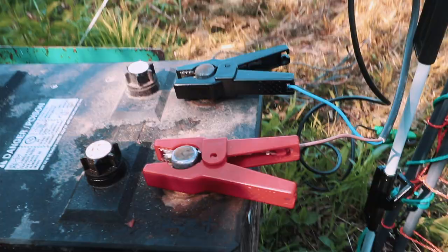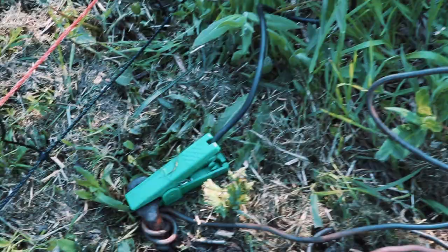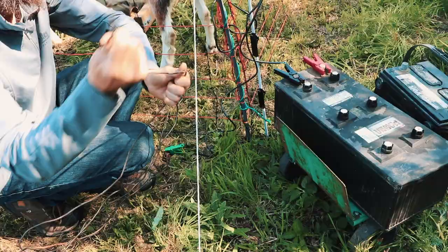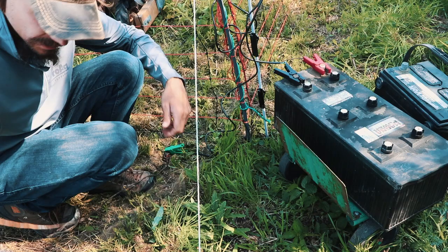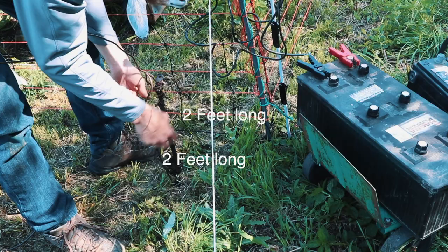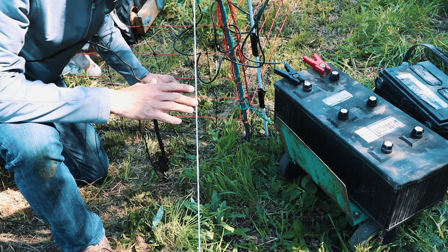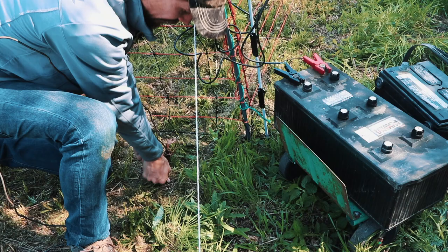The absolute biggest thing when you're using electric fencers on a battery is going to be the ground — I can't tell you how important that is. And that changes with how much moisture your ground has. This is actually copper wire I found in the junk pile, and copper is such a good conductor that I'm using it for my ground rod. This is the ground wire that goes to the clamp on the fencer, and I've pushed the copper wire and this metal rod into the ground. In spring, the ground is saturated and wet, so I've been able to push them right in — that's more than adequate to get a really good ground.